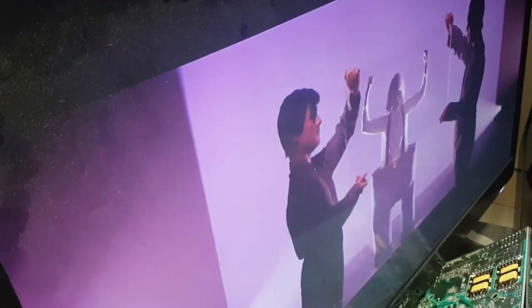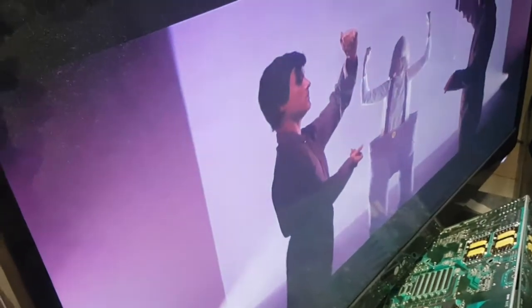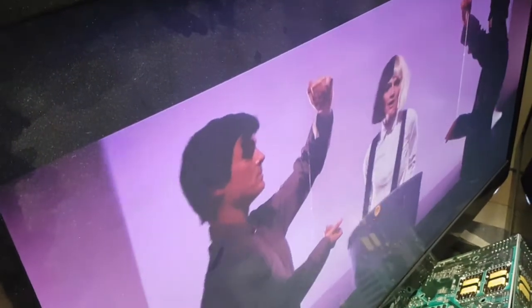And there was also the other problem, which is typical for those boards, which is the main processor, and we did reball it, and it did come up, oddly enough, but we don't know for how long it will work, and the customer was informed of that and offered several options. One of them was to see the TV working, and got no warranty for it.